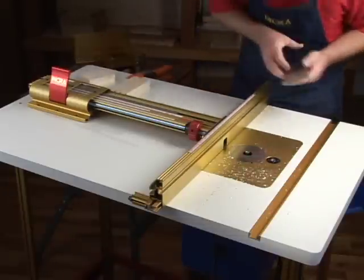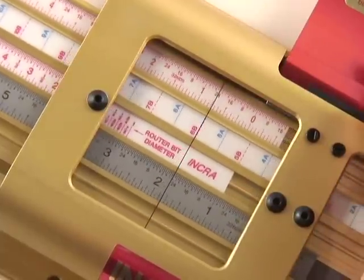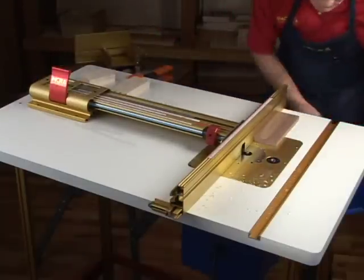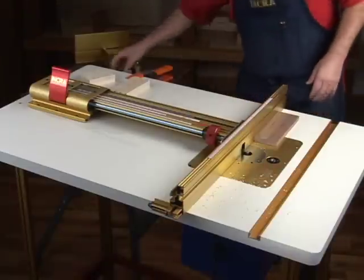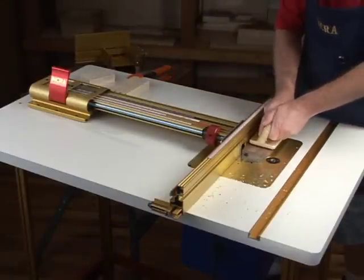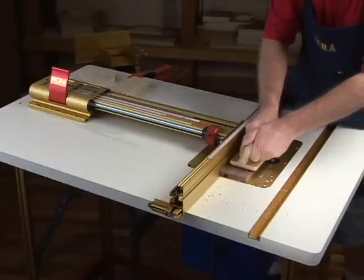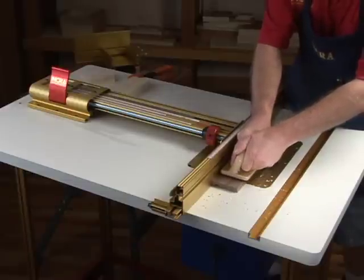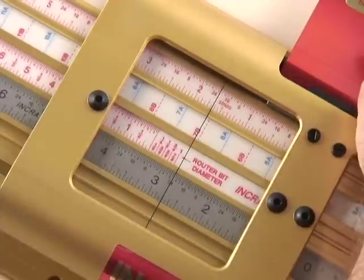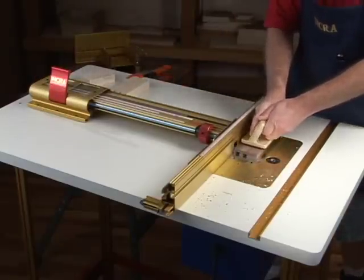To make the corner posts, set the LS to the first B mark on the template that exposes the cutter in front of the fence and lock the carriage. Using a rubber sole push block, cut a groove along the entire length of the corner post material. Now move the fence from one B cut to the next to cut the grooves across the full width of the corner post material.